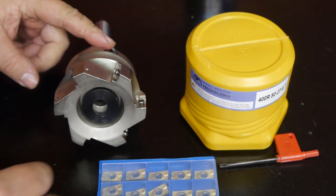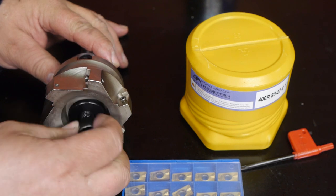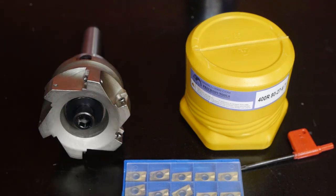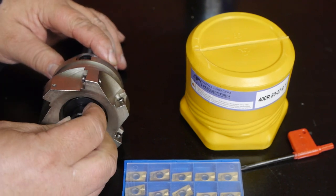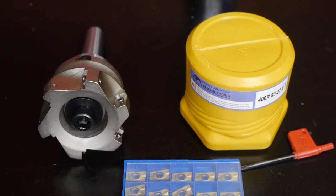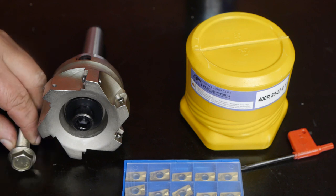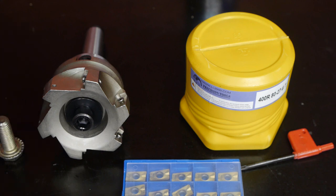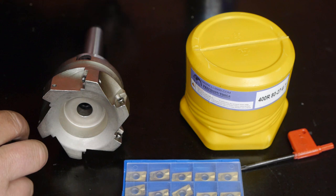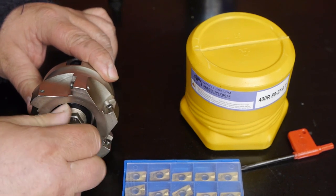It's a very thick washer. It looks like the thread only engages for two full revolutions — maybe even less. I don't like that. I'm going to search for a longer bolt. I found something in the used bolts bin; it's a bit longer, about half a centimeter, but it does have a different style head. I don't care — this should work, if it isn't too long. That's better.